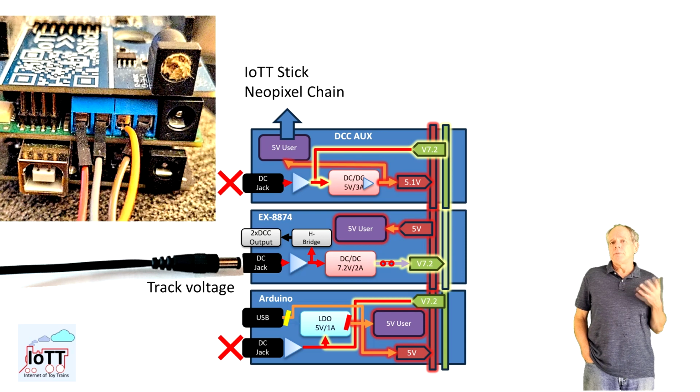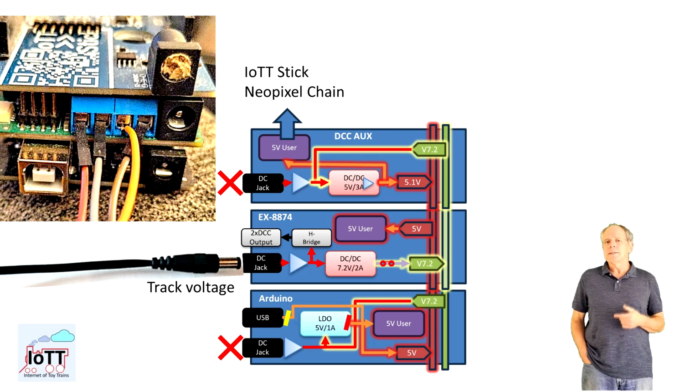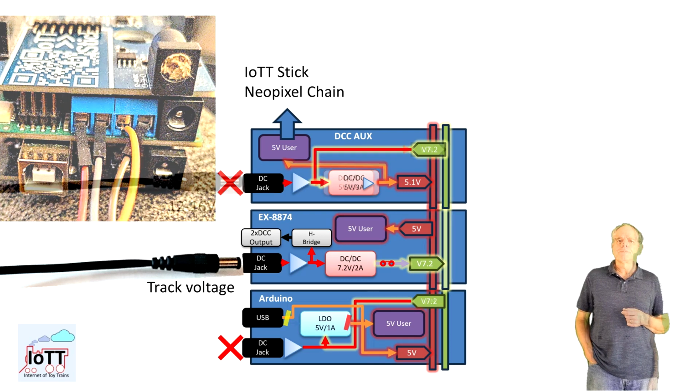Also in this use case, make sure you only power the stack via the barrel connector on the x8874 Shield. Using any other connector to supply DC power may cause harm to individual shields and should be avoided. It might be best to block off the connectors that shouldn't be used in order to avoid unintended plug-ins.